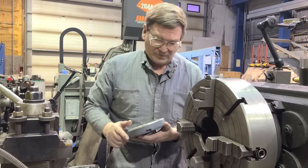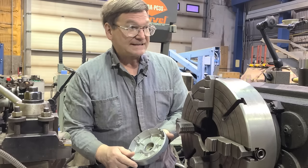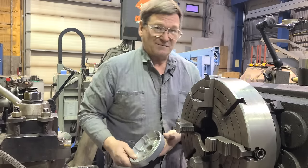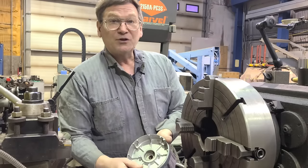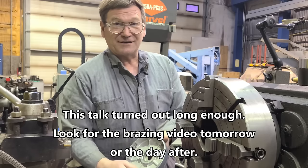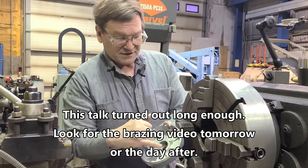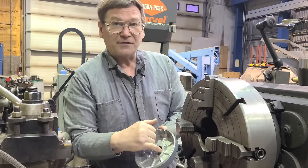There's quite a bit of discussion on this. Part of that is sometimes with a cast iron one, brazing them up works better than sleeving them - without having the worn out end bell here to look at, we don't know. So we're going to add a section on brazing. The reason you'd do that with a cast iron one is the end bell is real thin on the sides here.